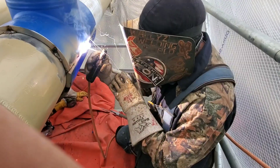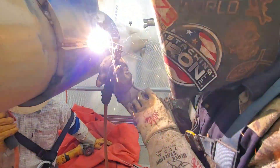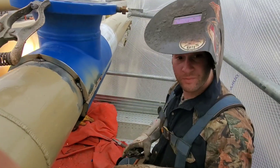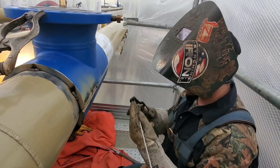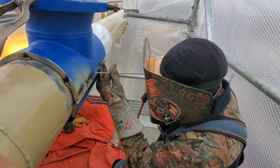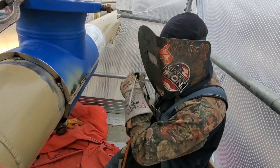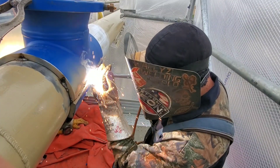Now that it's in there, the helper takes the wire wheel and wire wheels it out. It cleaned off the surface and made it good, and I grabbed some 3/32s and took off after it. The first welds we do are the 3/32s — that's just to get good penetration and not burn too hot and fork through that backing strip. I had to pick up my file and knock off the slag because sometimes you can't fire up on that slag.